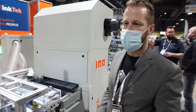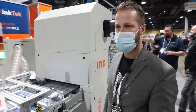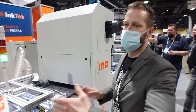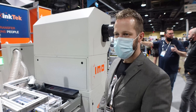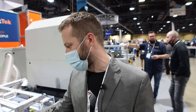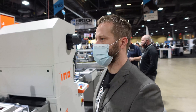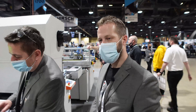From here on you would have a dryer. All dryers are electric powered; there's an option for infrared heaters too. In the front you can also have a UV unit if you're using UV inks. All the dryers are divided into sections of two meters, so you can really build your own configuration according to what inks you're using and your drying time. At the end you have a catcher or stacker — you just punch in the sheet size and it adopts automatically. Each section in the dryer can be individually set to different temperatures, so you can have gradual heating or drying of your ink, especially for water-based so you don't skin it. Sometimes you want to gel it, sometimes you want to cure it.